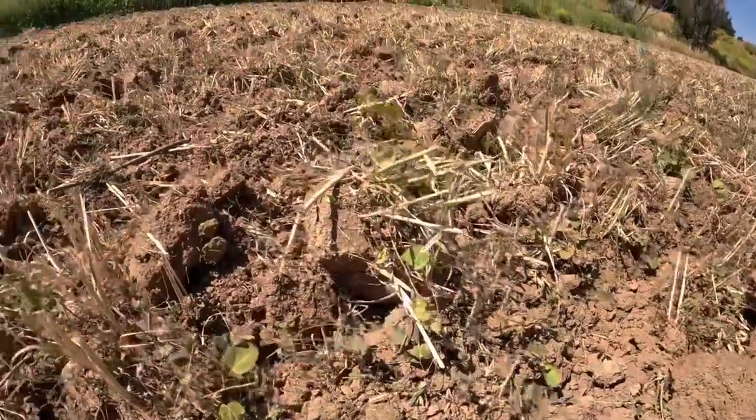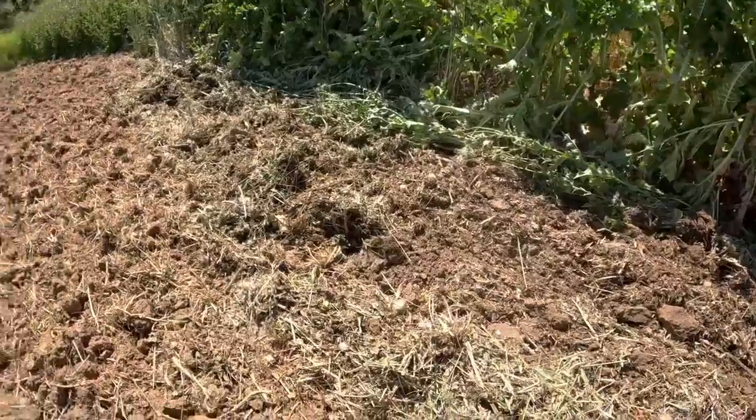The chisel does a pretty good job of working this up. The ground's already pretty hard, although there are some areas that still have a surprising amount of moisture. The only downside is that it leaves a lot of clods behind — the disc and roller would not be leaving clods like this, it would be a lot smoother. But I went with the chisel because it's wider, gets a little bit deeper, and it's better at covering grass and thistles. You can see these thistles are monsters over here — even after mowing and going over it with the chisel, there's still some plant matter on the ground, but the chisel has brought up a lot of dirt to cover it. I got my extra insurance passes done here along the levee. This fire break is maybe 60 feet. Let's go do a few more insurance passes up by the houses and then we'll be done.